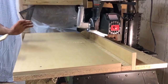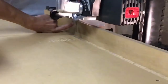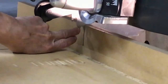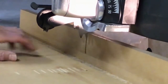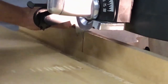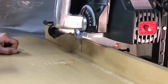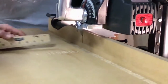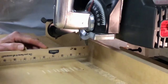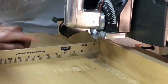This is not the best configuration because the blade protrudes from the front of the fence, and that's bad for two reasons. First, it's an obvious safety risk. Second, it doesn't allow you to cut thick stock because you have to have your piece of wood flush up against the fence before you cross cut it — if the blade is sticking out you can't cut anything thicker than this ruler.